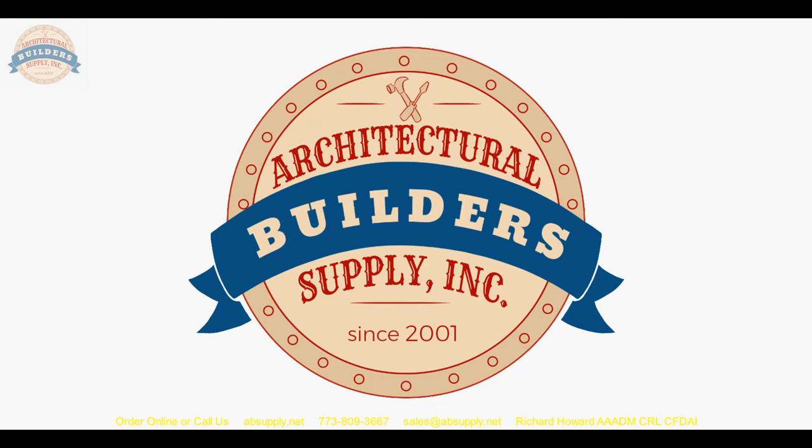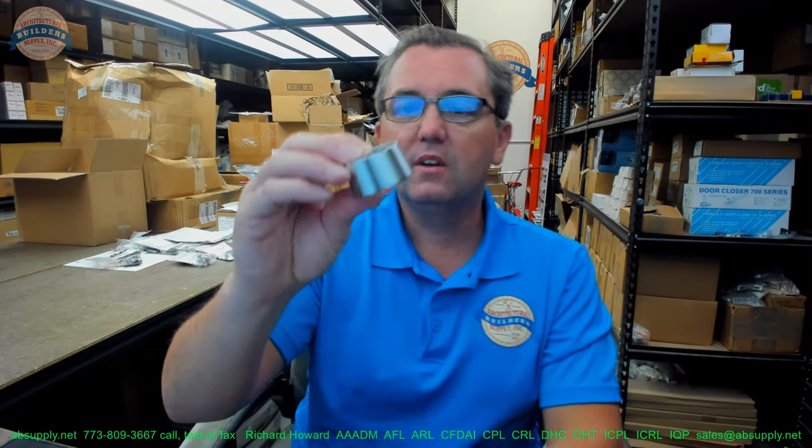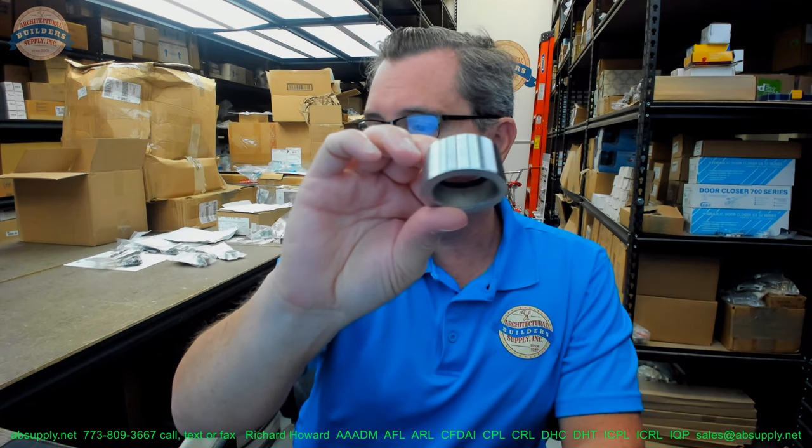Let's wrap up this video. The folks over at Keydex are a good group of people. I've called over there a couple of times just this year for technical support or guidance, and they're extremely agreeable — very helpful individuals who participate as if they're part of solving the problem. If you have any questions on the K-24L in 26D finish or any other Keydex product, please feel free to reach out to us. The cylinder guard ring is really a required piece of equipment because without it, you're presenting a would-be intruder with a very easy way to enter the space — a wrench, and they spin that cylinder off and can manipulate the lock.